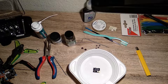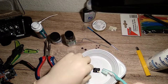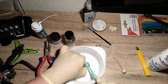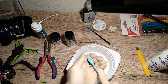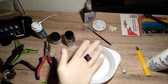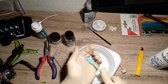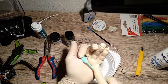Now we need to clean this piece of electronics. Spray the PCB with the alcohol and brush it with the toothbrush — either you do it in a plastic dish or do it in the glove, it seems more easy. You don't have to be scared to break much; if it's a soft toothbrush it will not break anything, and the alcohol evaporates in seconds.